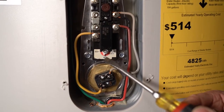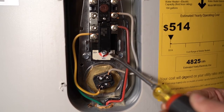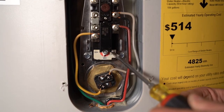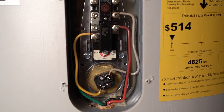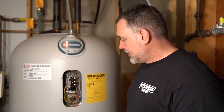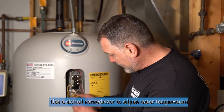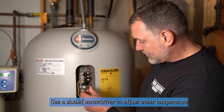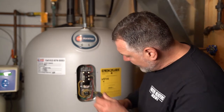As you can see, the thermostat setting right now has the arrow pointing just a little further than low. The low setting is 110 degrees. If you want it up to 120 or 125 — if the lowest was pointed at three o'clock, you want to be down about four o'clock, which is exactly where it is. That should be 120 degrees, a very comfortable temperature for your water. If the temperature wasn't satisfactory, you would just put your slotted screwdriver in there and adjust it: 110, 120, 130, 140. We want it right about 120, so we're going to have it pointed at four o'clock.